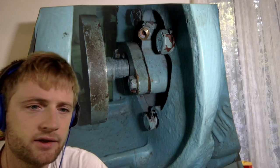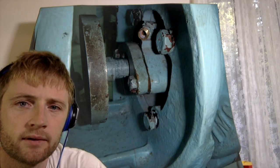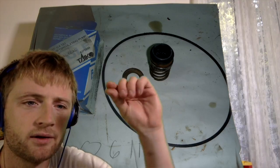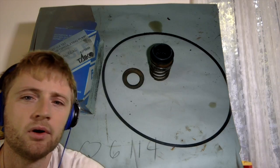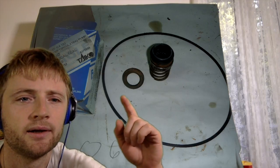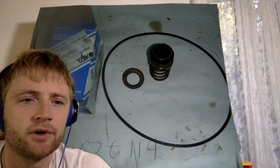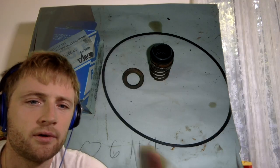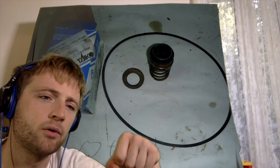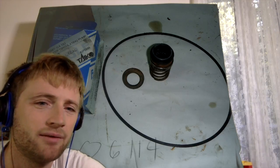Use dial gauges to set your pump properly. If your pump is removed, mark your place and the number of shims you removed from the bottom of the pump. Tighten the nuts equally so they share the pressure. The person tightening should do it from each side to control the torque of their hand so it will be the same, because different persons apply different torque.